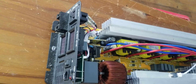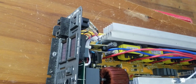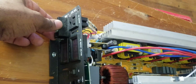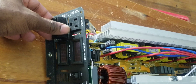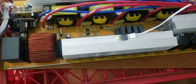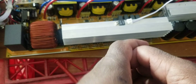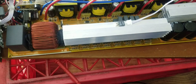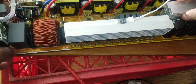After I overloaded it and it reset itself, I went back to my garage and saw the numbers were different. When I checked the voltage on the AC output, it told me about 69 to 60-something volts. That's when I knew something was wrong — I figured maybe some MOSFETs were blown.